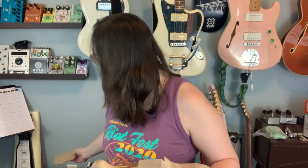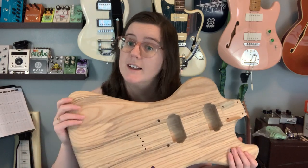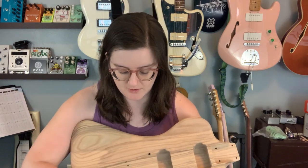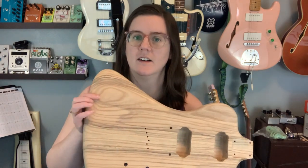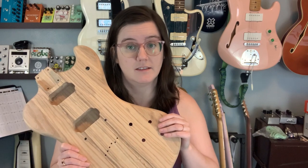So let's talk about what we're going to do with this. There are a couple of options. It's such a pretty grain that I could stain it or even dye it a certain color. I have before done a ceruse — I guess you would call it a dog hair finish — where I took purple leather dye, dyed the wood purple, and then used a white grain filler to get that dog hair effect. Should I paint it? It's just so pretty to paint, especially that grain right there — I like that a lot.